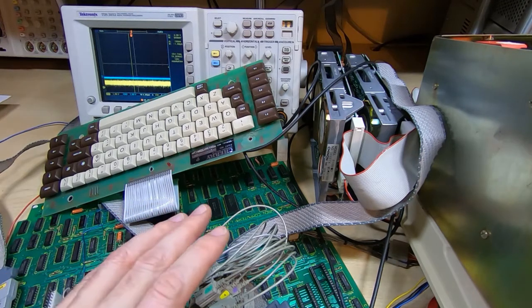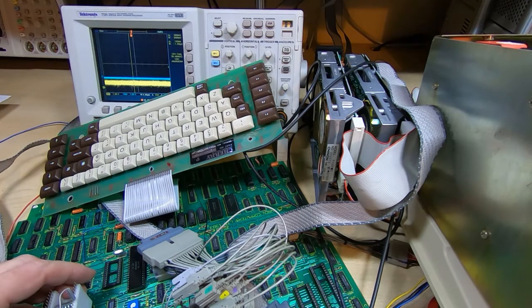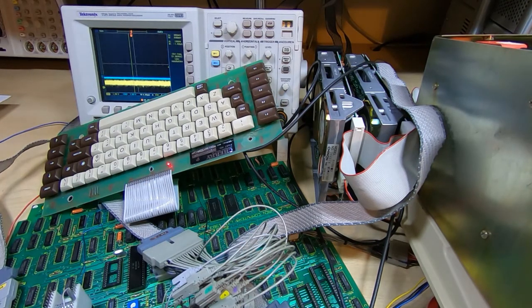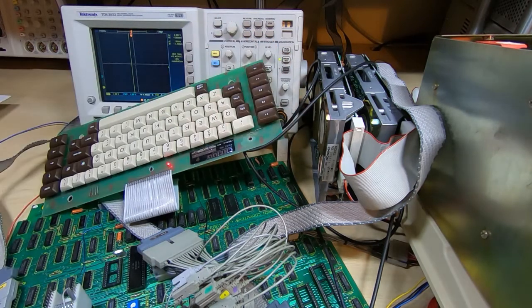So whereas before it was failing on the first peripheral device it came to and identified that as a UART failure, it was really a peripheral bus fault where every single peripheral device would have failed if the testing had carried on. So the other thing I'll do is quickly look at the data quality that we're getting on the bus now and see if it's any different.